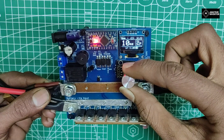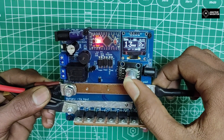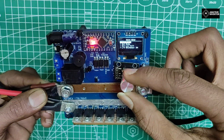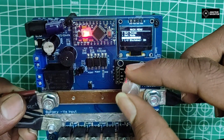Users can long press to save the pulse data, single press on the rotary encoder to weld, and press it twice to open the main menu. It has an easy to use graphical user interface to change the settings. It supports multi-pulse weld like 1P, 2P, 3P, up to 4 pulses.